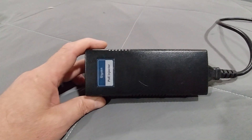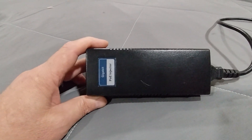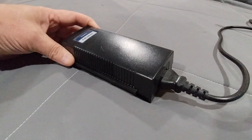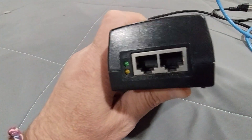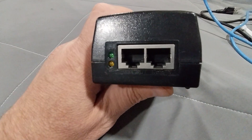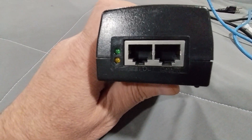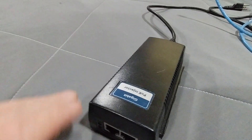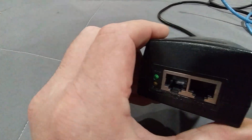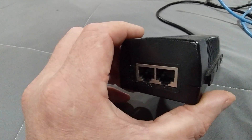The last component you'll have to buy separately is a PoE injector — I'll put a link in the description to a couple I recommend. A PoE injector powers your device through your Ethernet cable. Plug one end into the wall; on the other side you'll have two data ports. One says 'data in' and the other says 'power plus data out.' Be very careful — the power plus data out must go to your hotspot, and data in must be plugged into your switch or router. Plug in your network cables before applying power to the PoE injector, because plugging a cable in while powered could create a spark or power spike that ruins your hotspot. Make sure all connections are seated before powering up.